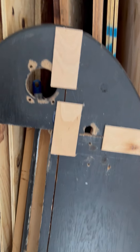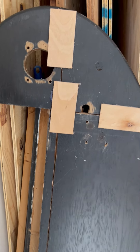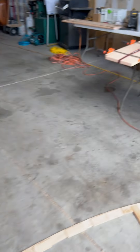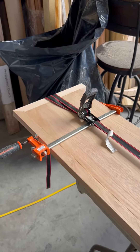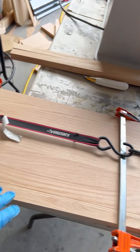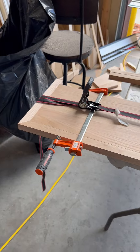I had to cut this off to get it carefully off without damaging anything else on the step. What I did is I just accounted for my kerf and hot glued it all back together. That gave me a template, so I didn't have to make a difficult template there. It has some open-sided stairs also on this as it returns back up. It goes kind of like a box pie shape to just a regular return. It was an odd size — I could have bought this already made up, but it was an extra deep tread, and I knew I was going to have to be fabricating everything anyway.